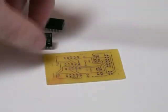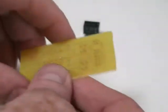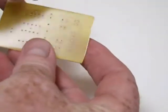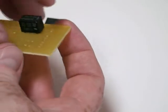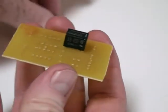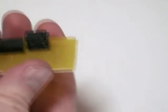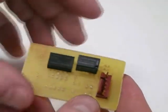We have some of our components here. Let's see how much easier it will be to install these instead of what we had when we were using the prototype board. We just turn it over so the circuitry will be on the bottom and the components on the top. That goes in there nicely. Put this relay in there — also nice. And how about these six-pin connectors? Very nice. You can see it's very easy to get them in there now.